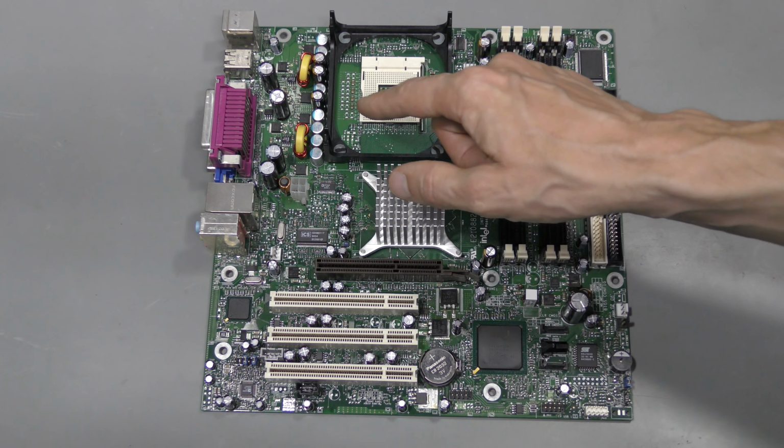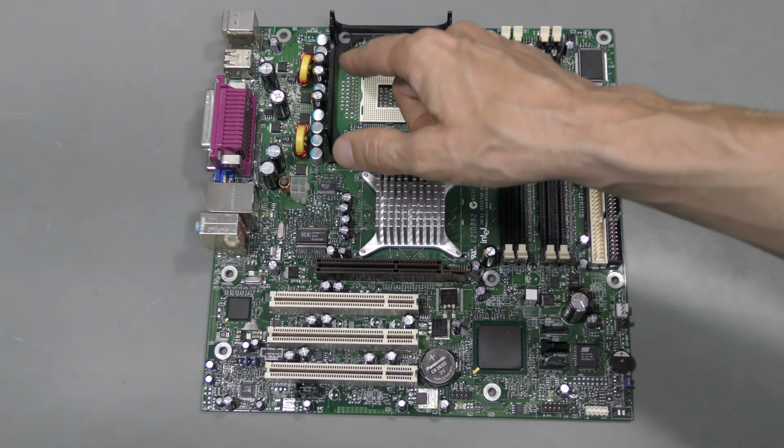It's quite difficult because of very thick copper tracks involved in this high current step-down converter, and I don't really want to struggle with this unless absolutely necessary, and I don't believe it's necessary. These polymer capacitors rarely fail and usually have very low ESR and dissipation, and this whole bank of capacitors is in parallel, and total capacitance should be slightly more than 7000, and I measured just that, and the ESR is just a few milliohms, so there is no reason to believe that anything is wrong there, and I declare this good enough.